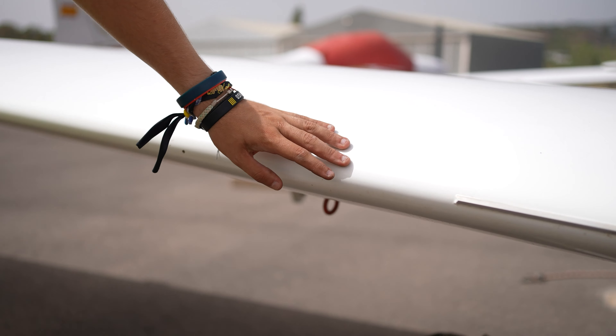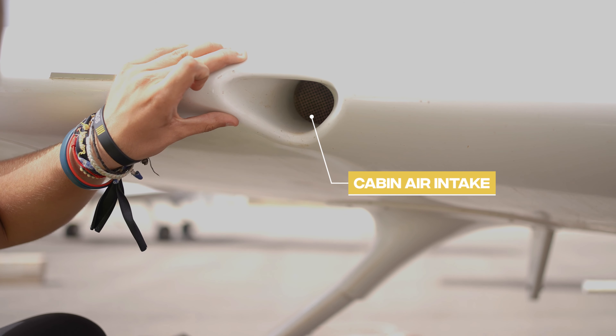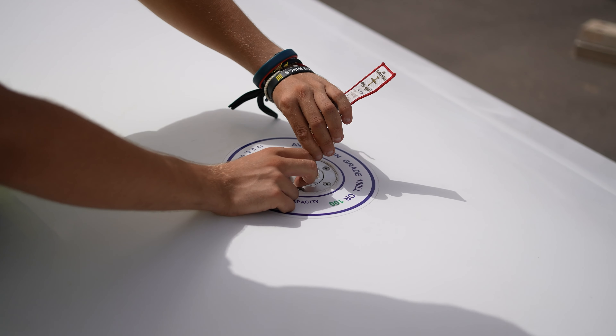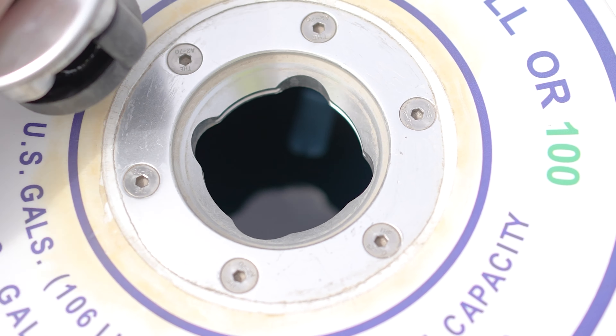Check the condition of the lights. Verify that the wingtip is securely attached. Ensure the vents are not obstructed. Ensure the leading edge is clear and that the stall strips are in good condition. Test the stall warning alarm by means of suction.